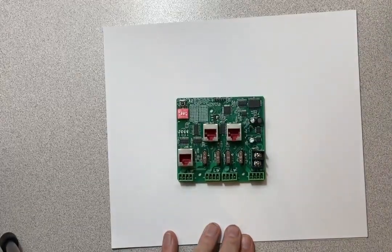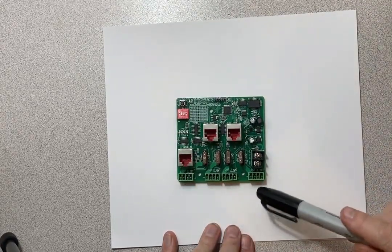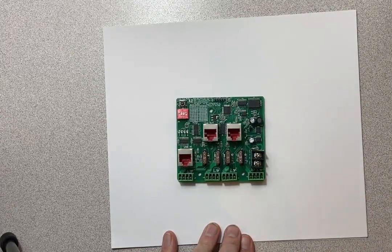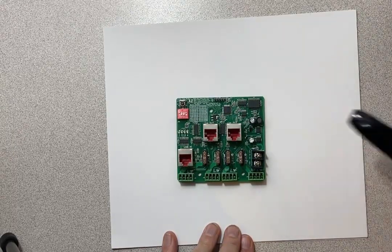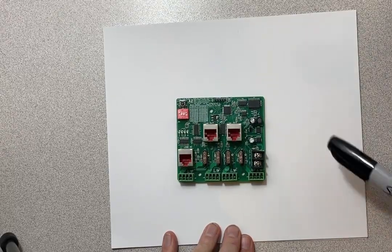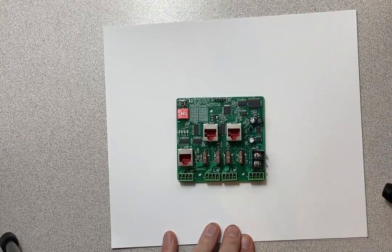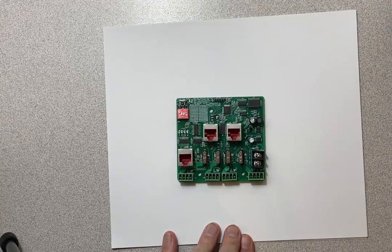There's a test button. When you press the test button and enter test mode, you'll get different colors of lights flashing directly from the pixels attached to your SPI board. It's very good for testing to make sure your pixel strings are actually working and separate that from the software lighting control that's coming from your controller. All these smart boards are also field upgradable, which means the firmware on the microprocessor on this board can be updated directly from the HinksPix PRO Controller through the long-range differential driver.